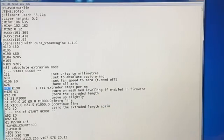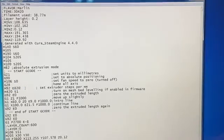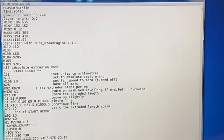The actual command here is M92. If you don't have this line you can add it in underneath G28, which is basically the beginning of everything before your printer does anything. Under G28 I've got M92 E190, which was my old extruder setting. There are various videos and websites on how to calibrate an extruder, so you'll want to find one of those to figure out what number to put in. In my case, what I found for this extruder with my motor and my printer was 820 — so I'll change this number to 820, save the file, and once I pop this G-code file into my printer it should print perfectly with the new extruder installed.